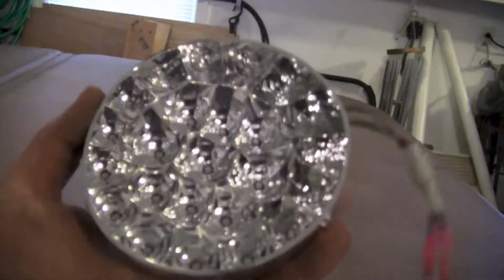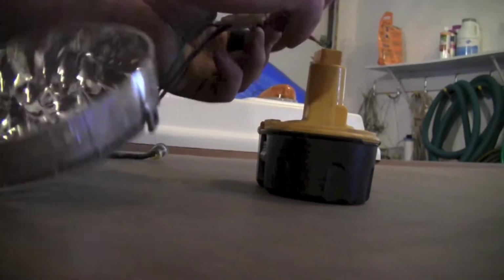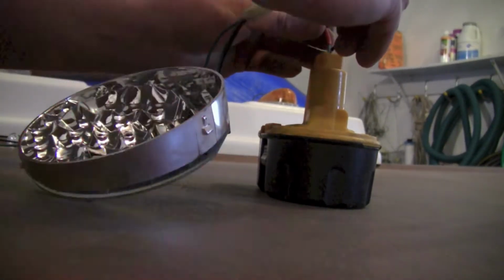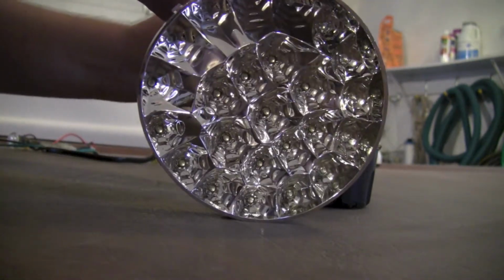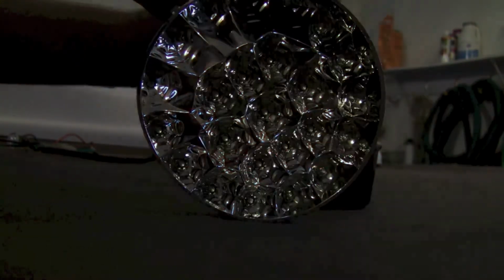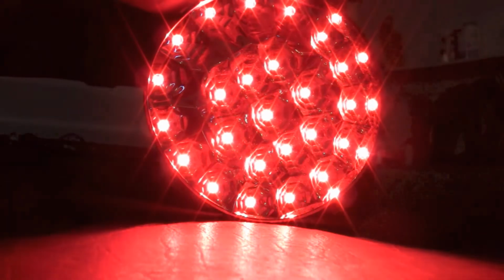And then I also noticed when I was driving it at night that it's hard to see the instrument cluster, so this is also harvested off of a Corolla taillight. It's just a red LED panel. Let's see if I can figure this out. There it is. It's dual brightness, and I chose red because it doesn't dilate the pupils. That's the brighter of the 2. And I'll probably go with the dim one. I might even dim it down a little more.